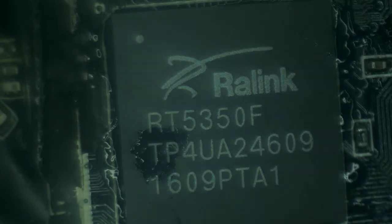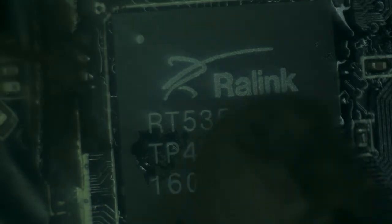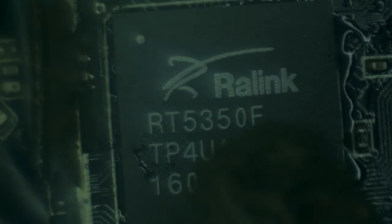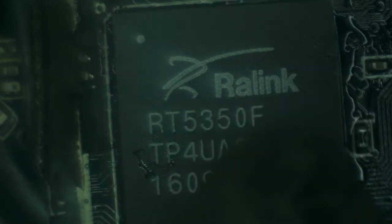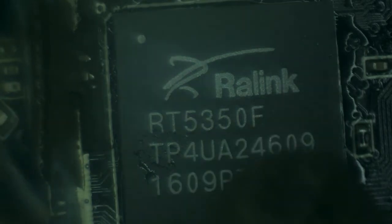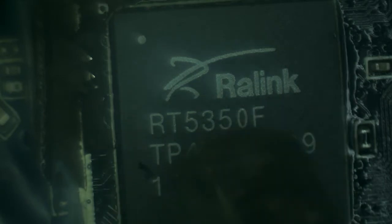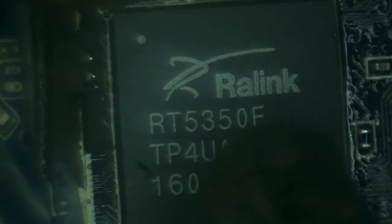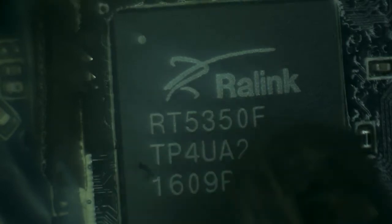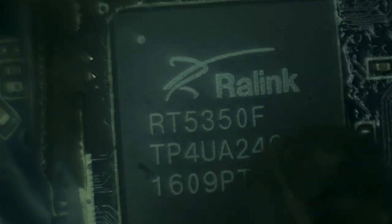This one I'm going to go gently on because I don't want the controller to move at all until everything is warmed up: all of the balls and the board. Once it's done, it's going to just gently dance under the... Okay, now it's not moving anywhere. That means that it's melting where it needs to go. And I think we got it.